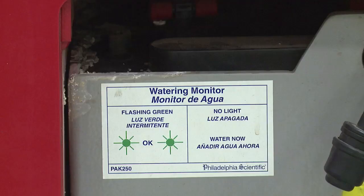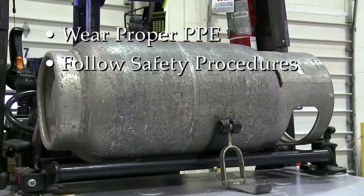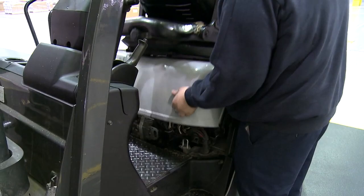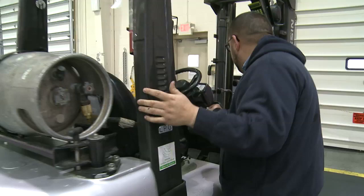When inspecting an electric-powered lift, check the battery level — often there is a gauge or indicator light to use. If the battery water level ever needs to be inspected, be sure to wear proper personal protective equipment and follow proper safety procedures. If the fuel source is liquid propane, the straps attaching the tank to the forklift should be present and secured tightly. Depending on manufacturer recommendations, inspectors may need to check fluid levels. Afterward, ensure the hood latch is secure.